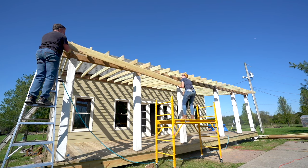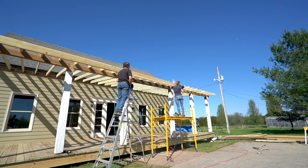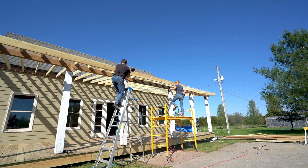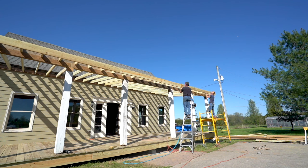Next we capped off the front of the rafters with another 2x6 — this is also called the fascia. We'd first pull a tape and figure out what the board needs to be cut to so it lands on the center of a rafter, then face-nail it directly into the ends of the rafters. A tip: use a speed square or another straight-edge reference to align this board. This keeps your roof line straight and avoids a bump that would result from flushing up the rafter by hand.